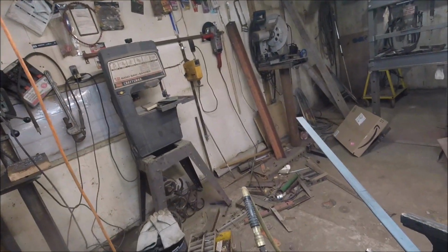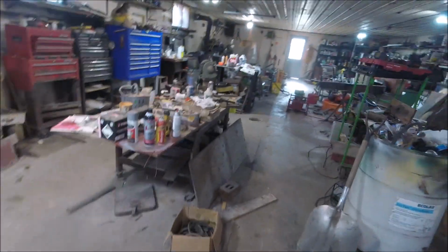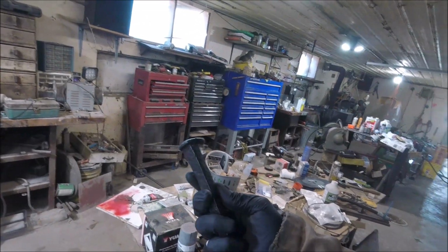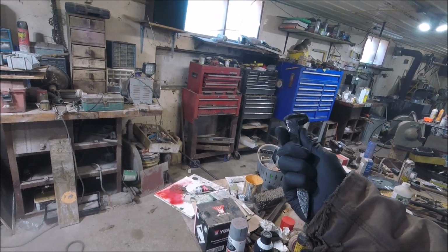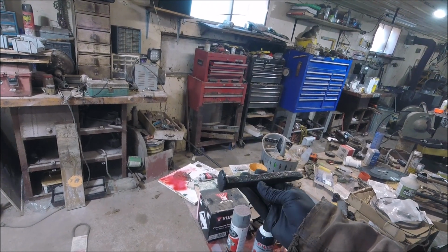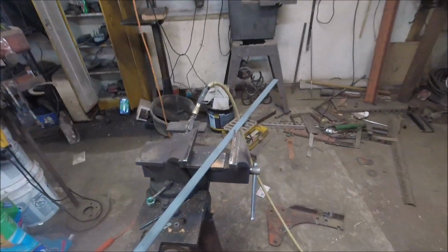So what I like to do for the patina, and I'll show you here, I was thinking about using this railroad spike on there, and this was all rusty and more pitted than it is now. What I did was I wire wheeled it down, and then my trick is this Schaeffer's Moly chain lube gives a really nice metallic finish to it. You basically just get yourself a paper towel, spray the paper towel with moly, and then just start rubbing it in, and eventually most of the moly will come off, and whatever doesn't stays on it, and just gives it a temporary protective coat, but it just gives it a really nice kind of a gray blue look to it, and then you can clear coat it. So that's what my hope is going to be for this. After I get done working on it, we'll get it hit down with the moly and then paint her up.